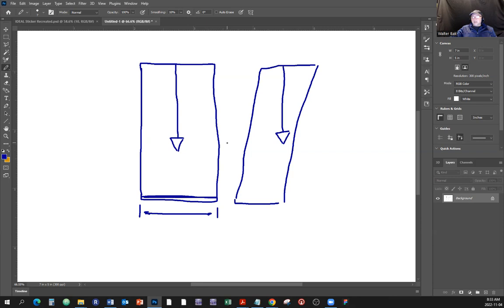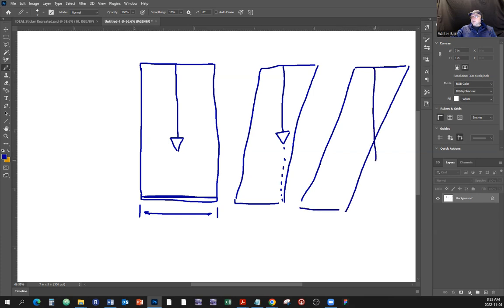This object, you can tip it as far as keeping the center of gravity within the base, within the shadow of its base. If you tip this object far enough that the center of gravity leaves the shadow of the base, so it's beyond the base, then the object is going to tip. There's no ifs, ands, or buts about it.